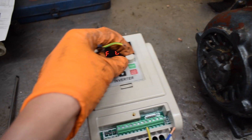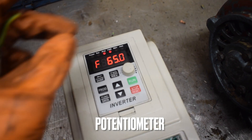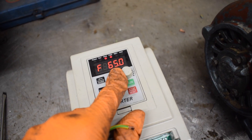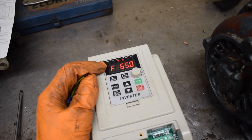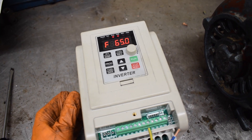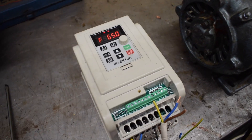The driver has a variable — I can never remember the name, but some people, or kids at school like I did, called it a dimmer switch and I got sent out of class for that. It's a variable frequency thing — I'll insert the name. I want to get one of those to mount somewhere on the lathe, along with a switch for jogging, and also a dial so I can have the RPM at the chuck end. Ideally you don't want to be touching any of this with oily fingers because it'll just disintegrate — it's only cheap and nasty — which is why I'm wiring it in externally from the VFD.